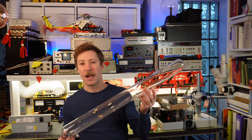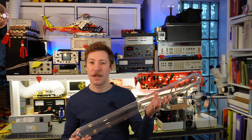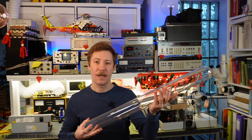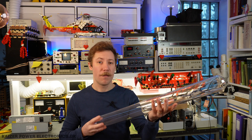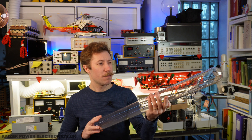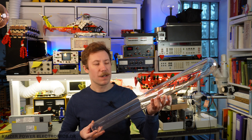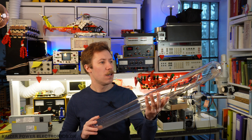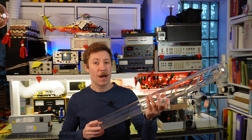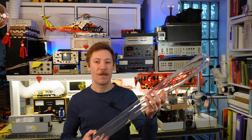I did not just buy two of these very large plasma tubes to play around with them with my Tesla coils. They are to be installed as a wall display in my electronics lab in the basement once that is done. What we are going to need is a driver putting out an RF-AC waveform in order to excite the gas inside. With different frequencies and different waveforms, you get different patterns in the tube, so I will have to think of something that can drive a variety of frequencies. The output power needed for driving two tubes is something in the range of 200 to 300 watts. What first comes to mind would be a flyback driver ranging from about 20 kHz up to 150 kHz, and then maybe Tesla coils for the upper range. And I do have a lot of vacuum tubes lying around, so what would be more fitting than building a vacuum tube Tesla coil to drive these two nice plasma tubes?